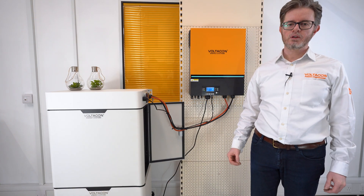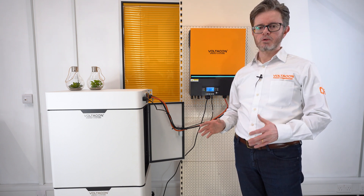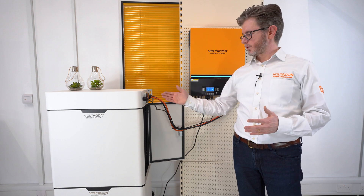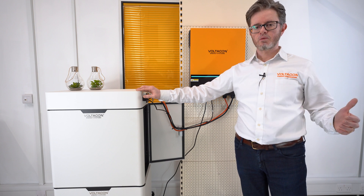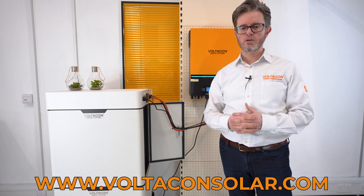We illustrated in this video how easy and safe it is to set up your off-grid solar system with lithium-ion batteries. The same procedure is applicable for other inverters with BMS communication. Our 5 kilowatt range of inverters, the 7.2 kilowatt and the 8 kilowatt, use exactly the same methodology to communicate with lithium-ion batteries from Voltacon, PylonTech, or other brands. The system is expandable — you can use up to 5 cabinets of lithium-ion batteries without a communication hub. If you are planning a much larger system, we supply the LV hub that enables communication of multiple cabinets to transfer information back to the inverter. Thank you very much for watching, and for more information please visit voltaconsolar.com.